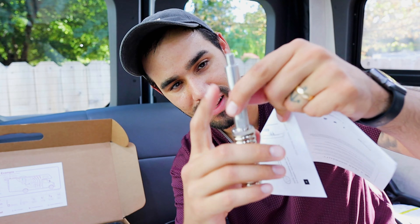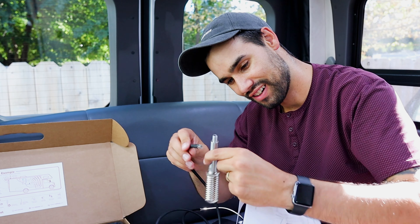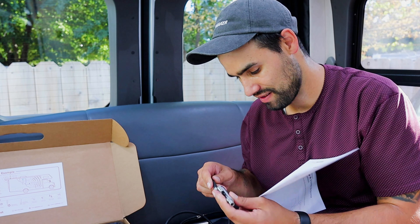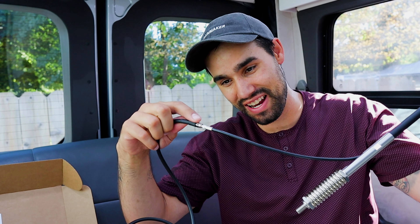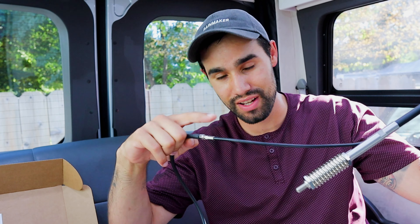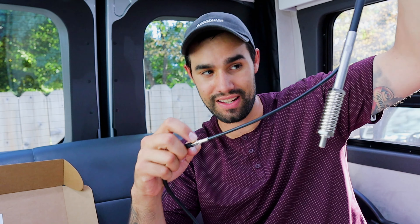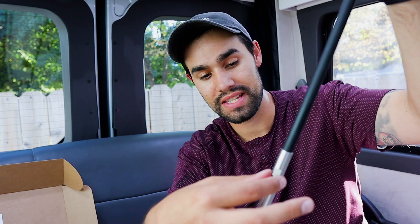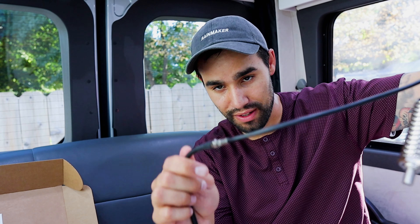The diagram says it's basically going to screw in here, the cord is going to come out of this little side thing. But when I'm trying to feed the cord through here I'm like — how does that fit? I'm missing something. Figured it out: don't thread lock the antenna cord to the 25-foot cord until you feed it through this side mount. So it goes: antenna, mast, side lock attachment — you feed it through, and then the spring is the last little part, then you connect the 25-foot cord.